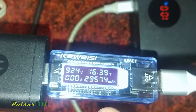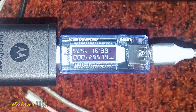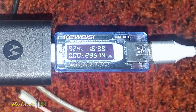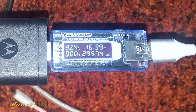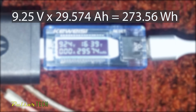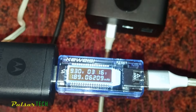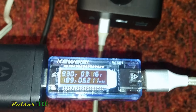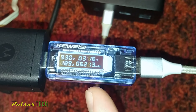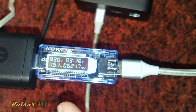The total amount of energy consumed is 29,574mAh at roughly 9.3V, though it fluctuated slightly — at some point it was 9.3V and now it's showing 9.24V. Taking it as 9.25V gives us 9.25V × 29.574A = 273.56Wh. This is 51.5Wh extra from the claimed capacity, which is around 123% of the claimed capacity. There could be some discrepancies due to the fluctuating charging voltage, and readings may not be 100% accurate since this is not a lab test, but it gives a very good idea of what to expect. There is definitely more than the claimed capacity.